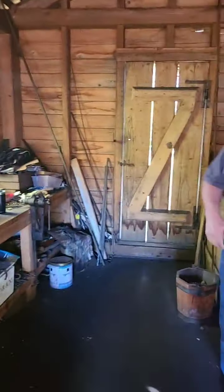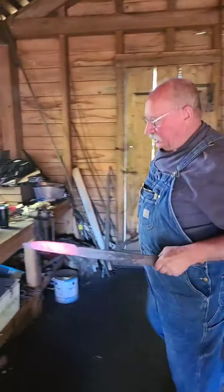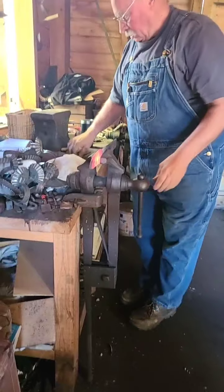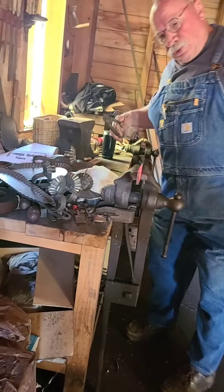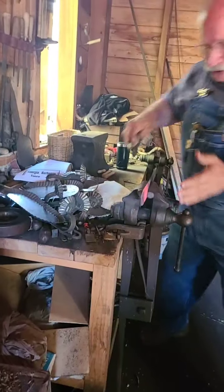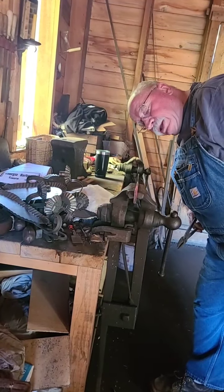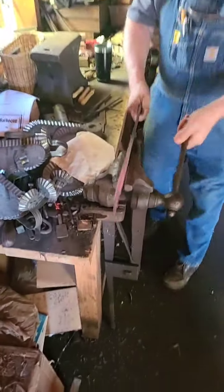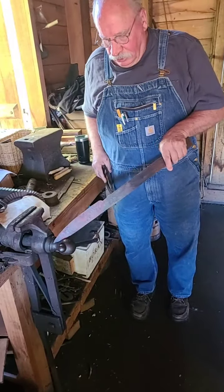Let's go to the vice and put a little bit of pressure on it. I just want to make sure that I've got something besides my fingers to impart that twist to it. From here out it's a little bit cooler than here, so this is the part that moved first - and that's okay, we're going to work on that first. We're going to get that in place. I'm looking down the edge, so we'll straighten that pretty easily. Always checking, always making sure I'm not going to grab something that's going to be too hot.